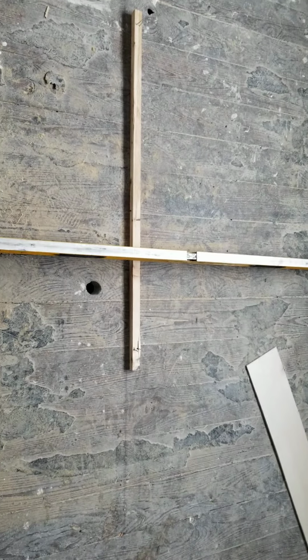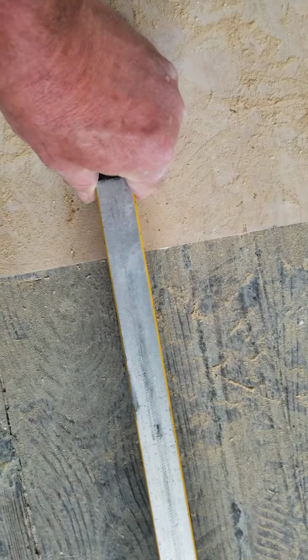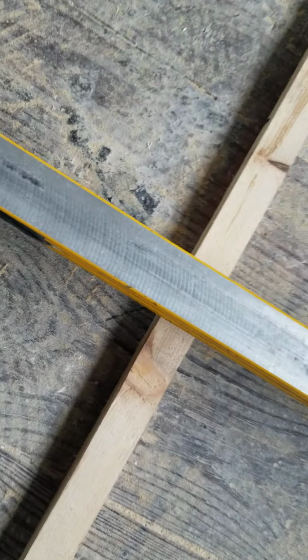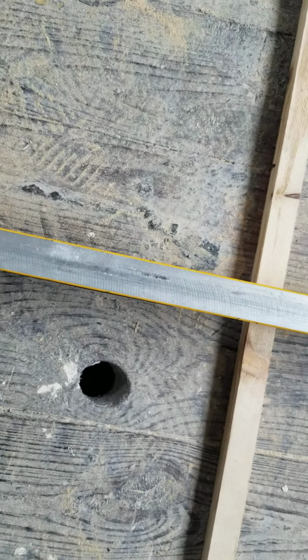Okay, upstairs on this front wall here, I have a faint red line chalked in. So what we're going to do is, this level right now, coming off of the underlayment, right at the edge of the underlayment, going to this board, this is a 3/4 inch board, which is exactly what your decking's going to be, and that's level. Just within this span here, from the underlayment to the board.